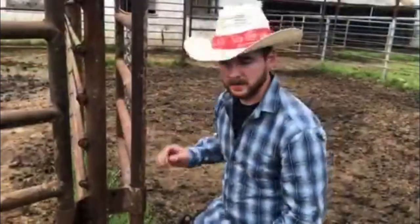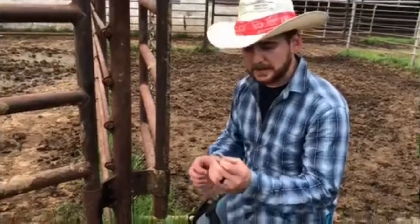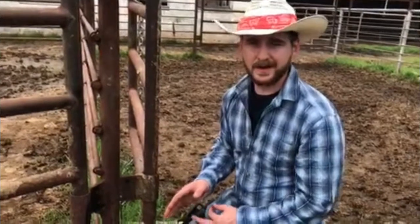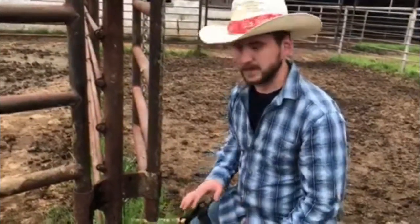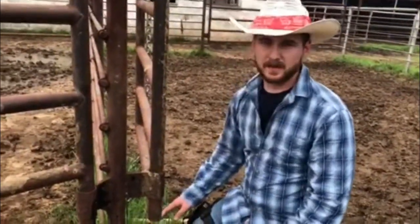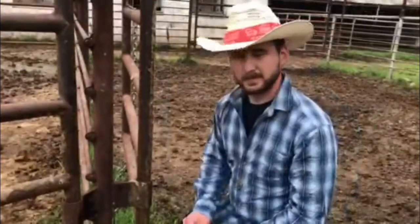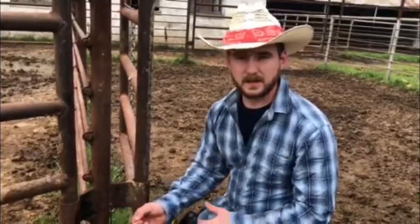You can see we punched through. If we move this gate a little bit you can see that center is actually starting to tap into the pipe of the gate — we don't want that to happen, so we'll call it good. We've got our grease fitting here and it's just a pressure fit, not threaded. It's going to take a little bit of force — we've got a rubber mallet, plastic mallet, a hammer, and a piece of wood as a cushion. All we're going to do is put that fitting there and whack it in.